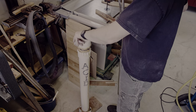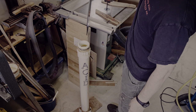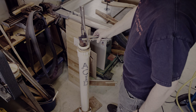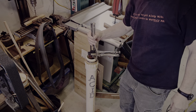To suspend the blade in my ferric chloride solution, I'm taking a strip of leather and some vise grips to hold the sword firmly at the tang. This allows me to submerge the blade and just leave it hanging in the ferric chloride for about 20 minutes. In this case, I forgot slightly about time and left it in there for 25 minutes, which made for a pretty deep etch.